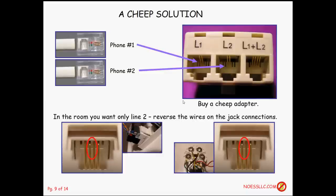There are two ways to get around this problem. The cheapest way is to buy a line splitter adapter — it has a plug that picks up all four pins from a jack wired for two phone lines. It picks up line one on the center and line two on the outside, and distributes them: pins three and four go to one outlet for phone one, while the outside two pins for line two are mapped to three and four on a second outlet, allowing a second phone to pick up line two.